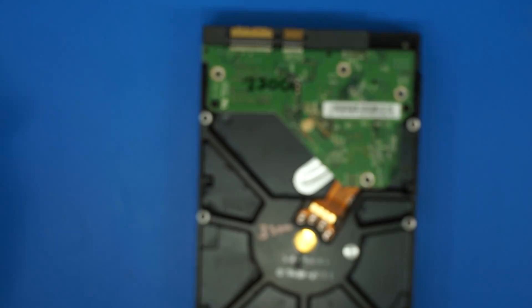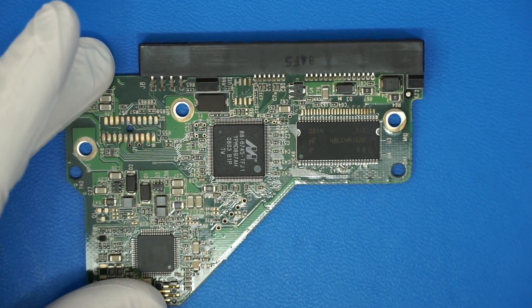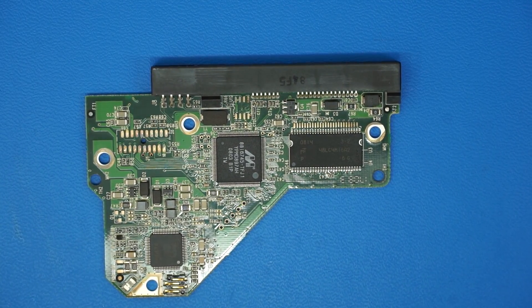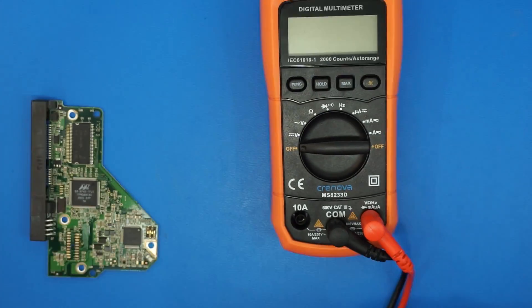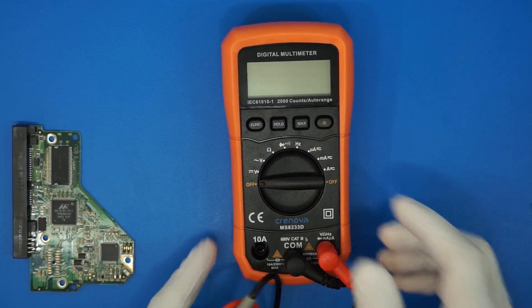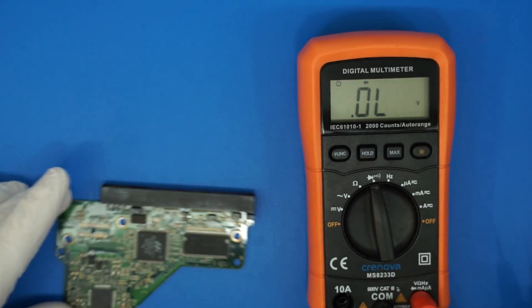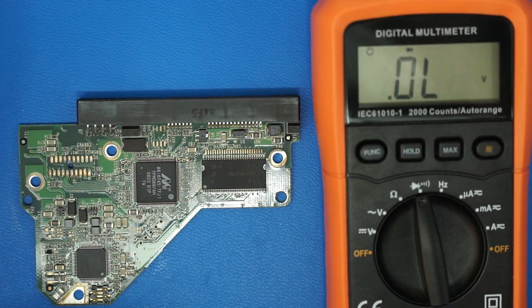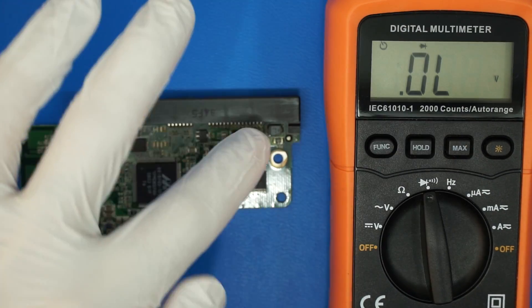I have a feeling this is just the 12-volt TVS diode. This is something I already measured but didn't remove and test anything else. The customer didn't give me any information, but since they said there's no power, you always start with the TVS diodes. It's almost always an issue of overvoltage — plugging in the wrong charger — which causes this type of issue. I'm going to use diode mode to measure these diodes.